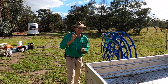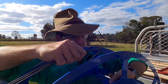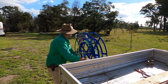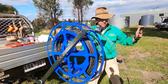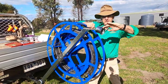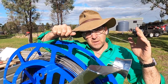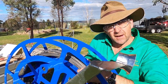Last test is five plain wires off the one fence at the one time. I've put a hook in the end of each wire and simply put each one individually into a slot, holding them all in place. Now I've got all five wires connected, let's start winding and see how easy it is. This is a one-handed operation once you get going — it's super easy. Just when you get to the end of the coil winding up all five wires, put a little bit of tension on yourself at the end. But otherwise this is going to wind the wires up so quick and easy. One of the five wires was a little bit longer so I'm going to wrap it around the bundle before taking the front off and that'll keep the coil packed together.